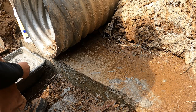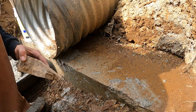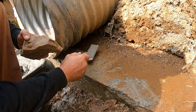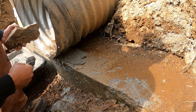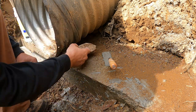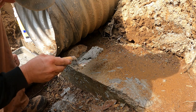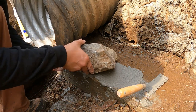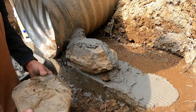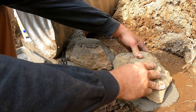I'm going to start right here in the corner. I'm going to get some mortar in there and spread that out. It's okay if I get a bunch in there. I'm going to poke it in there. This rock has got a little bit of a point to it — I'm going to wedge that in there. There we go. First stone is laid. I'm trying to get the faces to face out a little bit.